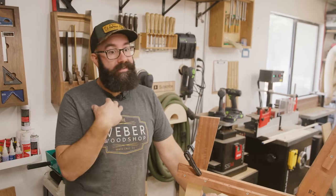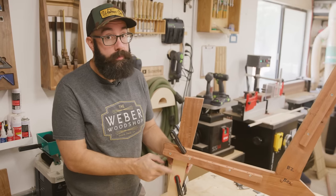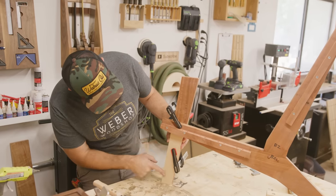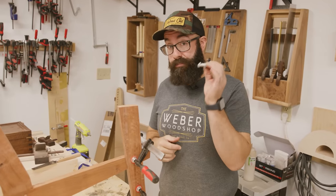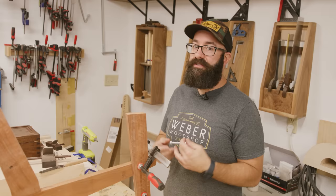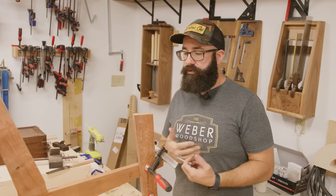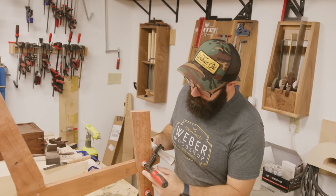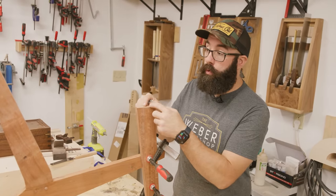One of the more difficult parts of assembly I anticipated was lining up the leg with the horizontal stretcher. I made a template that fills in the negative space and gives me a cleat so I know exactly where it goes — that'll be in the files in the description. To attach these two pieces I'm going to be using bolts. I really don't like exposed hardware, but this is an exterior piece and it just makes the most sense. Screws from the inside would come loose eventually; with bolts you can easily tighten them. I'm going to have two bolts so the piece can't rack, and I don't want too much stress on the hand rest joint.